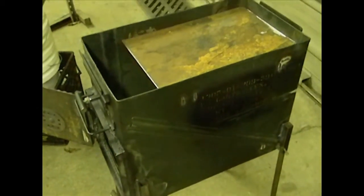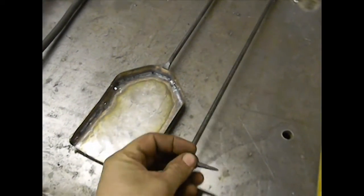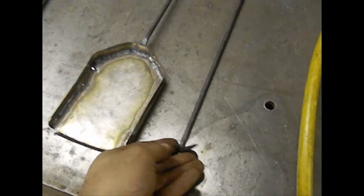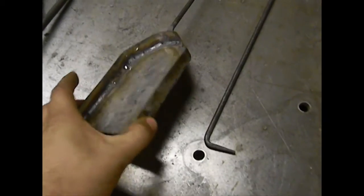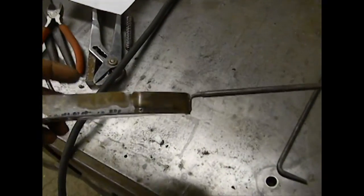As you can see, that's not going anywhere, and I would be more than confident putting that in a tent. Last but not least, I made a couple of basic fireplace tools. I have a little hook for moving wood around inside. And I also made a shovel — the head is stainless steel, that's really all I had laying around the shop. I offset the handle almost as if it were going to be a riveted handle, but I did TIG weld that on as well. What that allows me to do — come over to the stove here — I can really get in there and lay the shovel flat and go all the way to the back of the stove, and then lift it out. So that should be pretty good for cleaning.